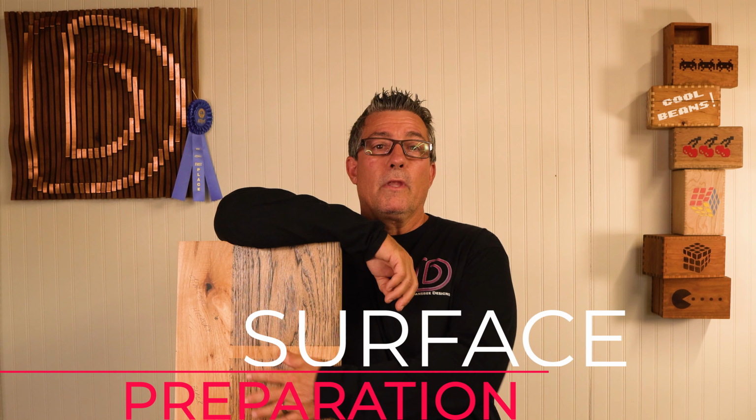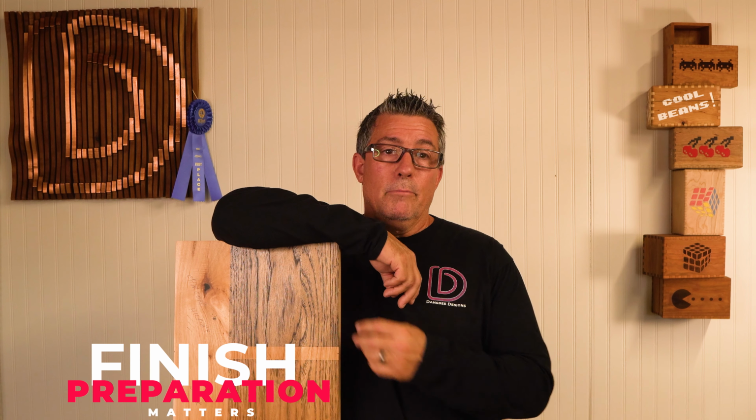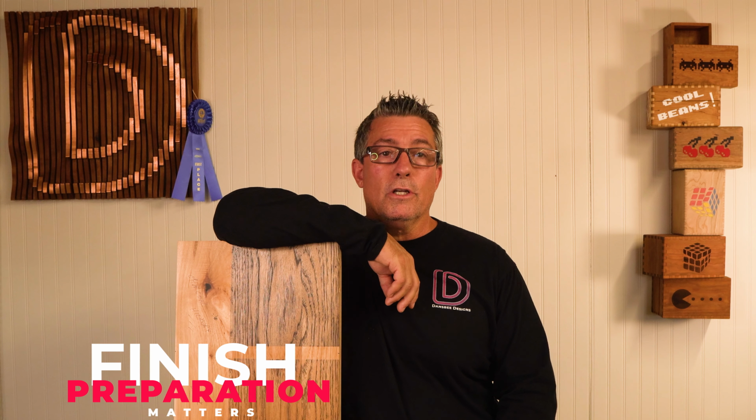Tip number two, surface prep. Making sure that your surface is properly sanded and cleaned prior to applying any finish will help ensure that the product performs the way you expect it to. Tip number three, finish prep. Making sure that you've prepared the finish in accordance with the vendor's guidance is crucial. Don't just add some of column A and some of column B and expect that things will go well. Use measuring tools and follow the instructions for more predictable results.